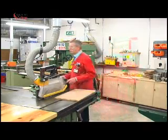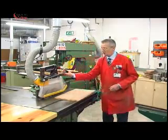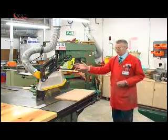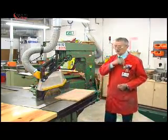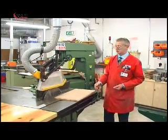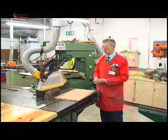So before we start playing with some serious stuff, we'll isolate the machine so we can show how the crown guard is adjusted. There's a lever on the top. You can see now the blade is exposed. We've got the blade, we've got the riving knife. Everything that we've discussed and learnt so far is already on this machine. The PUWER regulations state these things must be in place.